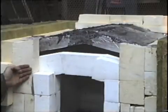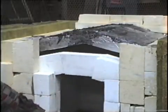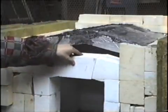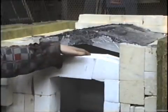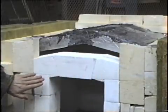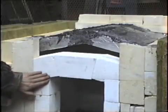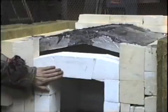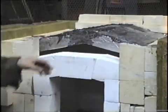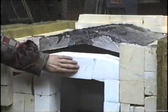For the outside course, I'm starting with a K-23 brick on each side. I haven't cemented the inside pieces in place yet because I wanted to fit all the pieces first. So now I'm going to cement the front face in place to make sure it's nice and flush with the front entrance where the door will be resting, and then I'll back up the inside pieces and cement them in place. I didn't want to cement the inside pieces first because I didn't want them to influence the position of the outside pieces.